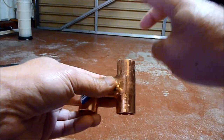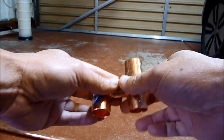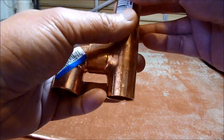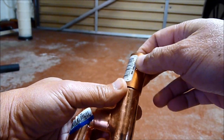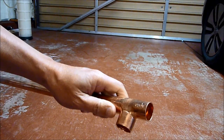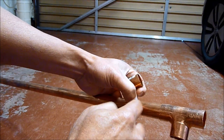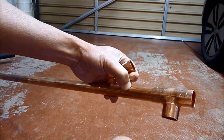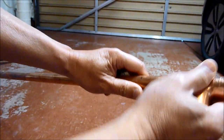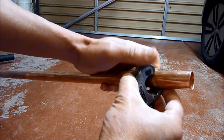Okay, so it's time to make a new branch. This one is going to be the hot water to the washer and dryer, and this one is the one we're fixing. We're going to connect another pipe in here — make a pipe that's long enough, push it in here to go to the top, all the way in, with an extension. So we're going to cut right here for this one and also this one, and solder straight through so we don't have to make an extra connection. We mark it here and use this to cut.